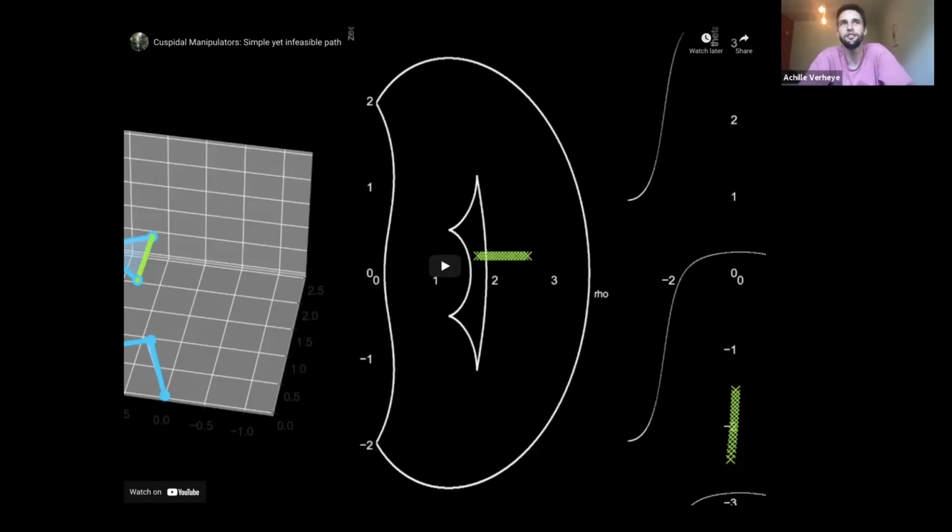I think so too. Outside of the industrial robotics space, there's definitely a lot of low cost robots getting made, like you're saying. And if anyone should know about this, it's definitely them, because it's actually pretty hard to make a robot that doesn't have offsets. You want to have your motor and then a link attached to it, and so you would have to offset that by having a motor that's inverted and so on. It would just be easier to have that offset. And it's not like offsets mean cuspidal robots. You can perfectly have those figures that I was showing earlier.